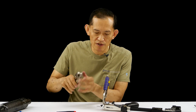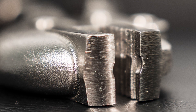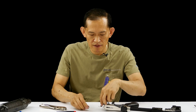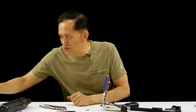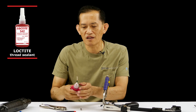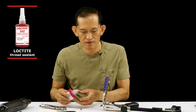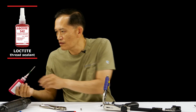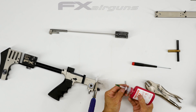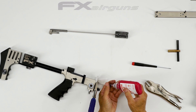What I'm going to do is use another modified vice grip — it's half-moon shaped so it doesn't gouge it, but gives it a nice grip. You want to jam it tight once the lock-tight is in place. I'm using red lock-tight since it holds up better and I can still remove it. Apply it on the threads.